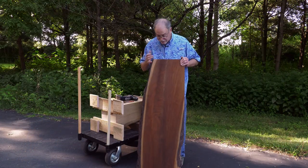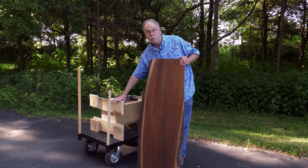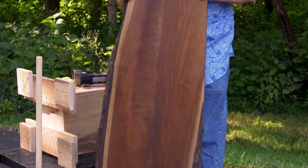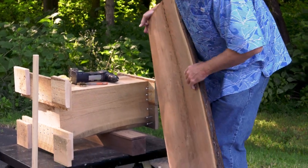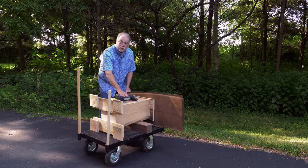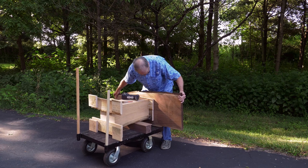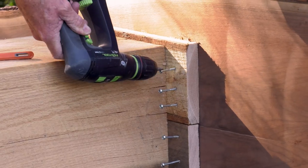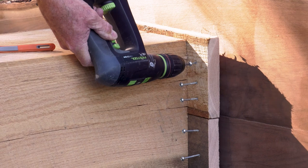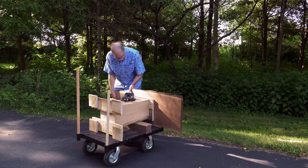This is the payoff right here — a live edge slab for a tabletop that's going to the Gurtners. I made a pedestal base out of chestnut oak scraps left over from their job. Find the glue seam in that board — you match the grain and away you go. This has armor seal on it and they're going to top coat it with a urethane oil. Now I'm going to join this all together using the right size square drive washer head screws on pre-drilled holes. We'll get this married together and off to the Gurtners to put a smile on their face.